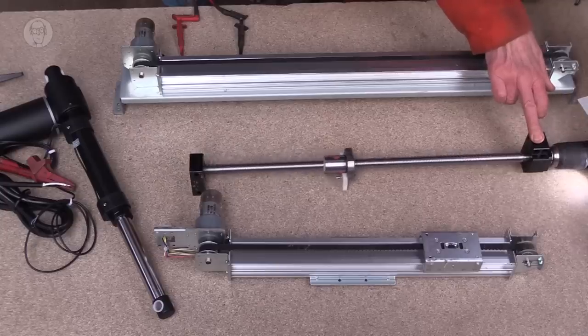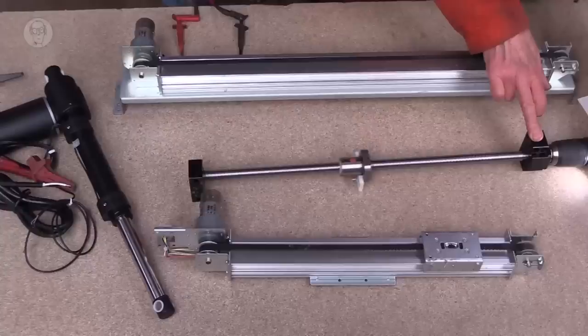So why then has pneumatics remained so popular in factories and automation? Well, I think really it's just because it's so simple and reliable. Once you've got the compressor, it is just a matter of plugging in a valve and a cylinder, and you've got this linear motion. You don't need limit switches, no other control, and they have very long lives. None of the pneumatic cylinders in any of my arcade machines have ever given me any problem, or the valves.